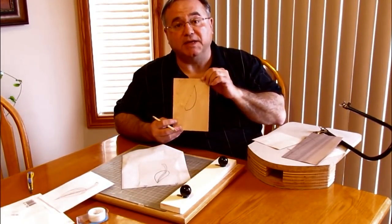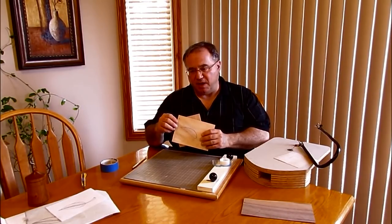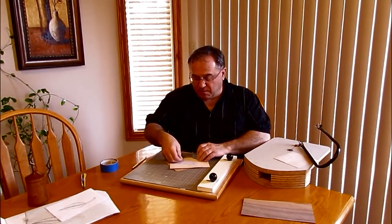Now we're ready to begin cutting. With the double bevel technique, both pieces are cut at the same time. The field piece is at the front and the part to be inlaid is inserted behind. It's best to cover both parts with some cello tape to hold the veneer together, especially where there are short grain situations. Then align your insert piece and tape it to the field with some blue masking tape.